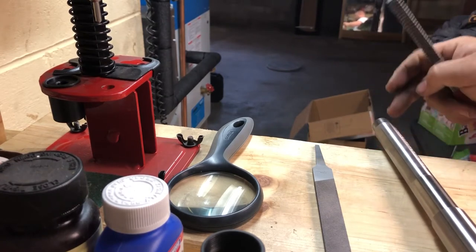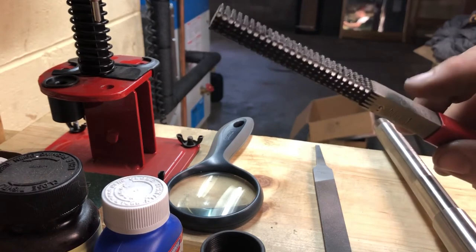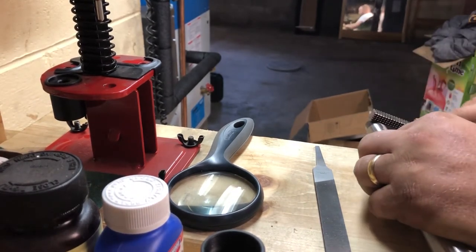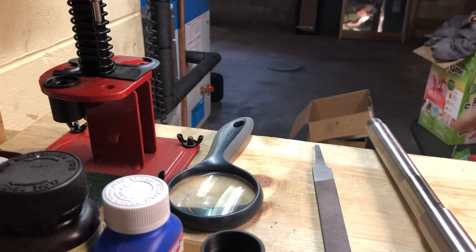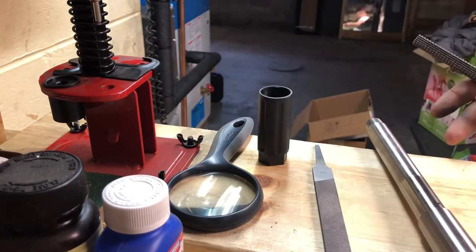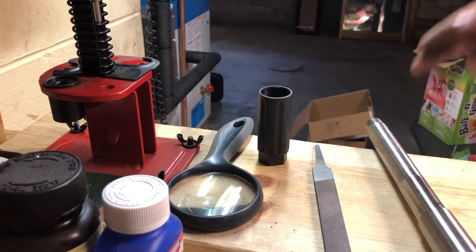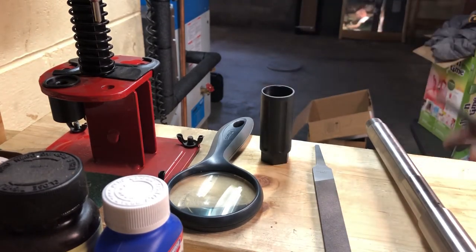I'm using this thread conditioner on the 24 — when I look at it I see the 14 marking, but I'm using the 24 side. What I'm doing is rolling it forward and I'm feeling it hogging out some of the root in there. The root's not deep enough. I think this comp is actually going on better now. It's been stopping at the exact same point every time — five half turns plus two-thirds of the next half turn, so about two and five-sixths rotations. Now I go that far and it starts getting tight but can go further.